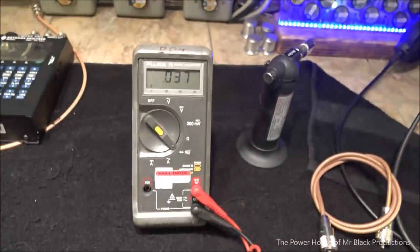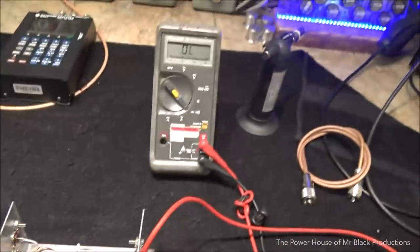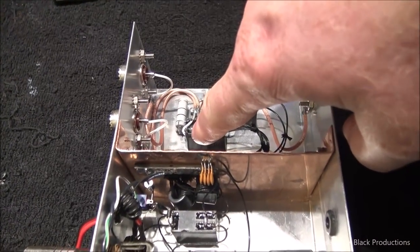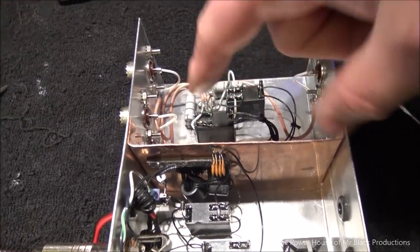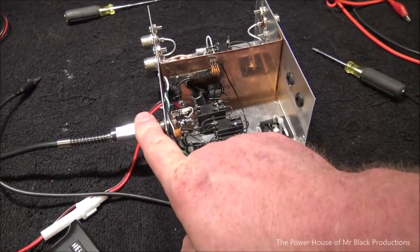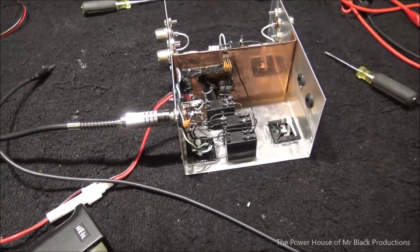So now we're seeing the resistor. And now on the other side, it's a beautiful thing. Okay, so I changed a couple things. I had these two wires backwards, my 12 volt source here, and I had the working movement here backwards. So those two wires flopped, and then I had to bring the remote jack up to the ground terminal. I didn't show that. Other than that, this thing worked just as designed.